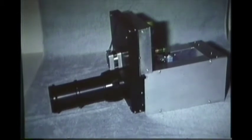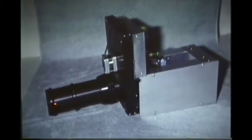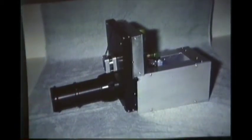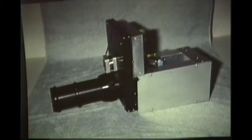Okay, this is the camera itself. It has, at the moment, got the eyepiece projection adapter on it, so there's an eyepiece inside here. Light goes into this end. There's a collet here which allows the camera to be taken off of the adapter. There's then a box here. This will give you an idea of the size. This is about 8 inches square, this box here. And in there, there's a shutter wheel and a filter wheel. That's the stepping motor that drives the shutter wheel around. The aluminum boxes have the electronics in them. The CCD chip is in the vacuum chamber that's hidden behind here, we'll see that in a few moments. Just for reference, there's a vacuum valve sitting down here, which we'll see in future photographs.